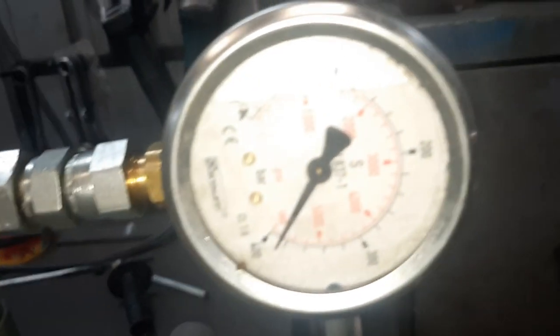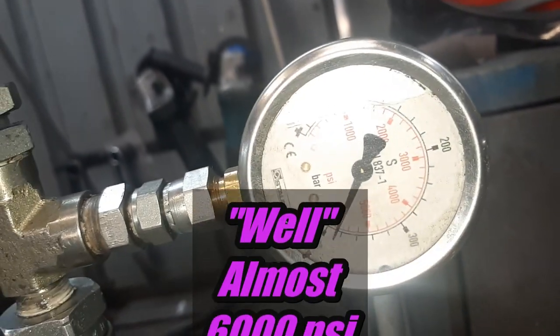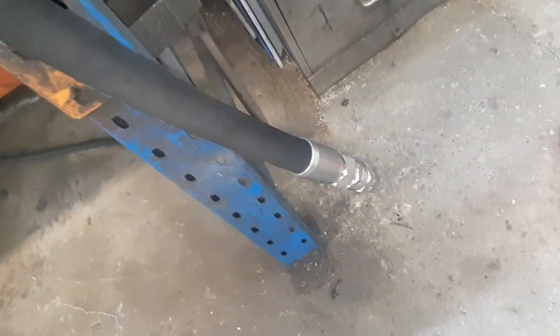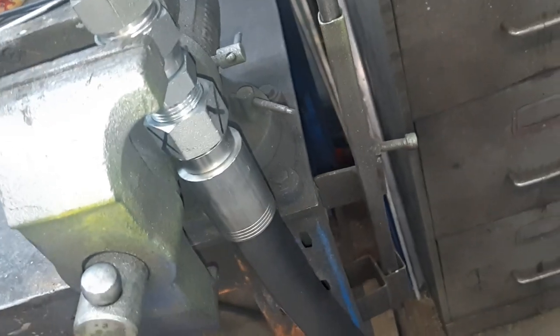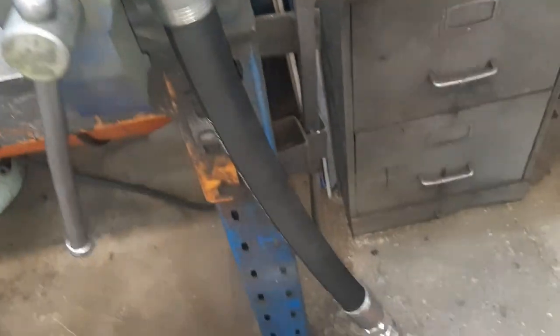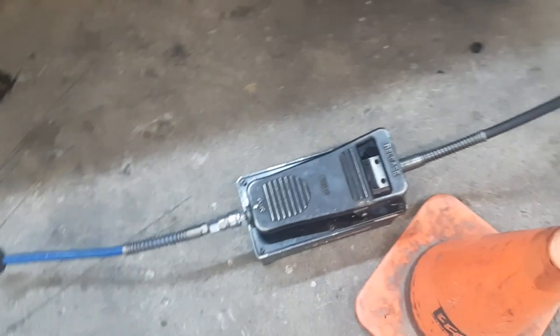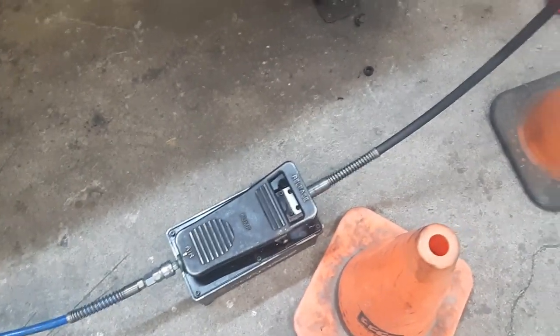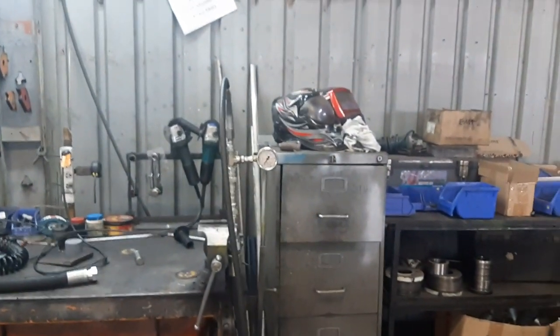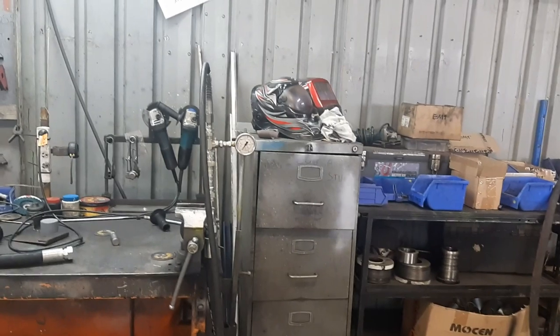But just to prove it, I'm going to go to 6000 psi and leave it there for 24 hours just to see what happens. So far so good, but it's only been 10 minutes. I'll come back tomorrow lunchtime and see what's happening. We're using a 10,000 psi hydraulic power unit to supply oil. By lunchtime tomorrow we can approve this for use at half its current test pressure.